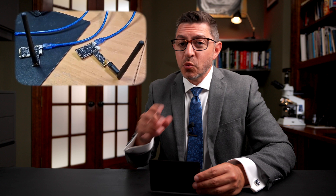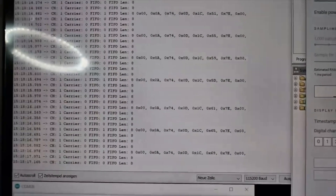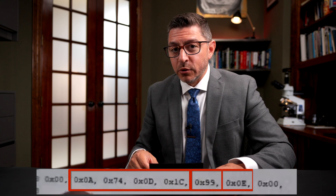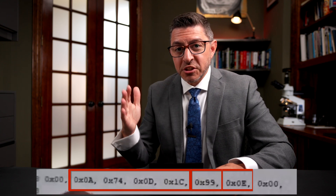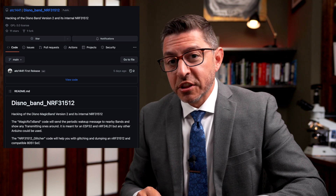On to the Disney Band. Aaron used Ghidra to label the firmware he dumped off of it, labeled a bunch of functions, and figured out how it works. He then set up two ESP32s — one as a transmitter and one as a receiver — so he could trigger the band to transmit and see the data it was sending. He has a current detection system watching the band to see when it spikes, confirming his transmit signal woke it up. The band sends an ID, a counter value, and battery level, blasting this data and staying on for quite a while before going back to sleep. His ESP32 code is on GitHub, linked in the description.